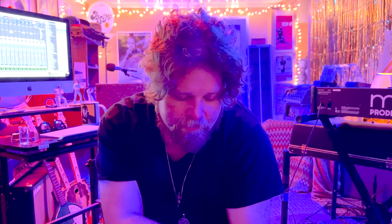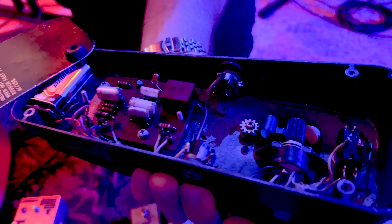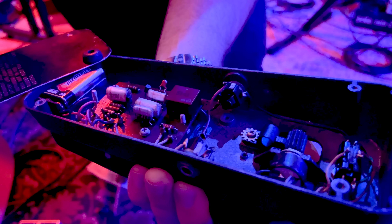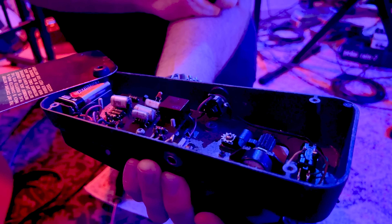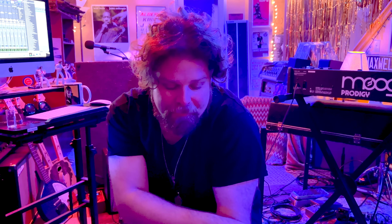The inductor makes a difference, but I don't mind the sound of these plastic inductors. The ones before this are the stack-of-dimes ones; there's also a trash can — it's a little silver one. I had a really nice trash can Vox ten years ago, one of my favorites, but it went microphonic. When the inductors go microphonic, there's really nothing you can do — you can literally hit the side of it with your foot and hear it through your amp. It just becomes unusable. There's stack of dimes, trash can, and the original halo inductors.